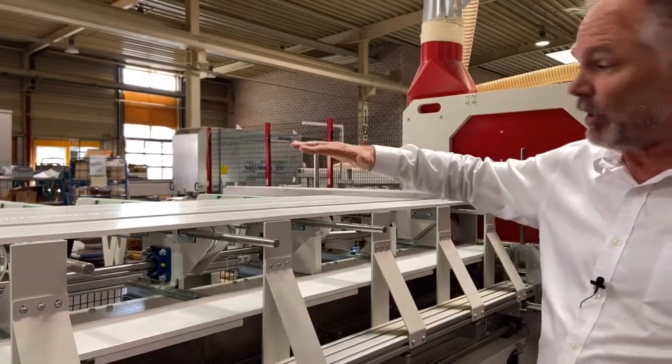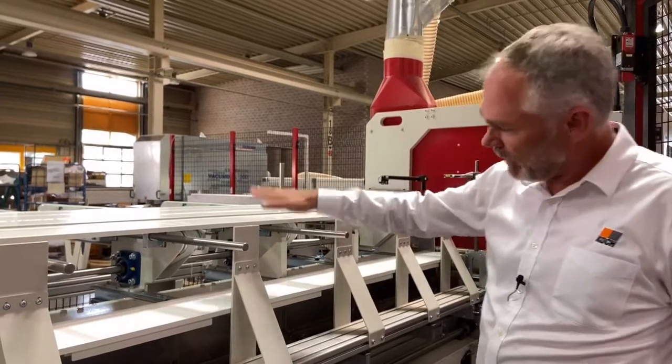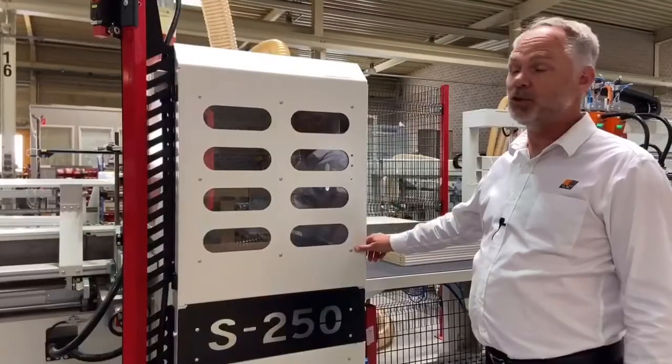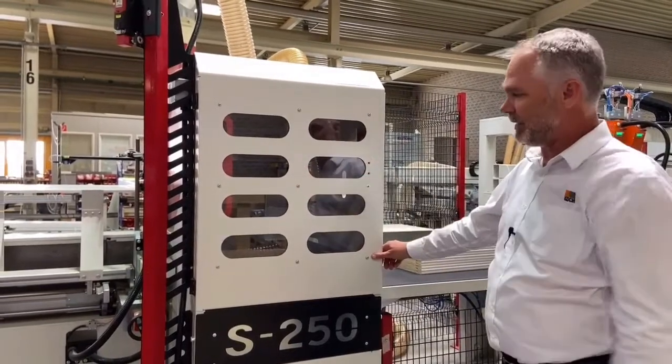These wrapped profiles are then introduced into the machine in a dual system. In other words, it builds one book while the secondary book is being passed through to be processed by the cross cut saw. The saw is fed by an NC controlled pusher arm that introduces the workpieces into the saw.